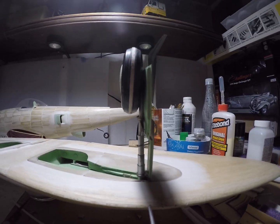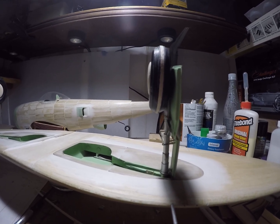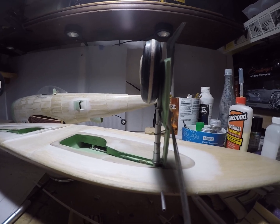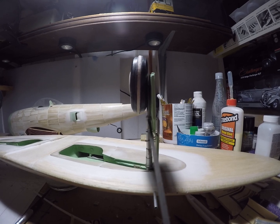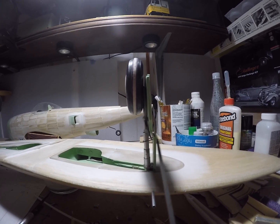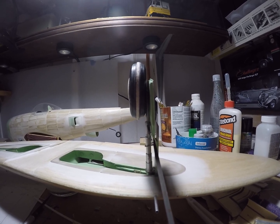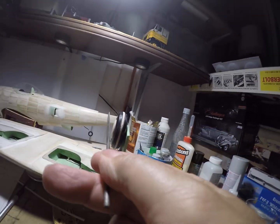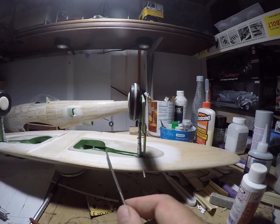You can see that the gear look is about right to the prototype, the actual P-47. You can see how the upper doors released and extended out from the lower door, so that when the oleo compresses and the aircraft contacts the ground, the landing gear oleo shock absorber compresses and leaves room for the lower door to slide up and underneath the outer door.